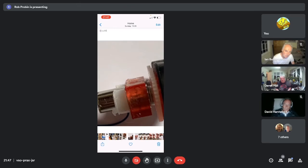Next to that, you can see an M2 washer. There's a 2mm bar that runs through as the axle. What you can't see through the resin is that there are two bearings back to back in the resin. These are 6mm outside diameter, 2mm inside diameter, and I guess must be 2.5 millimeter thick, so there are two of them back to back. The mount side you can see there is 5mm wide, and that white thing on the end is just something rubbishy I knocked up, which I haven't actually trimmed properly, to stop the axle falling off the end.